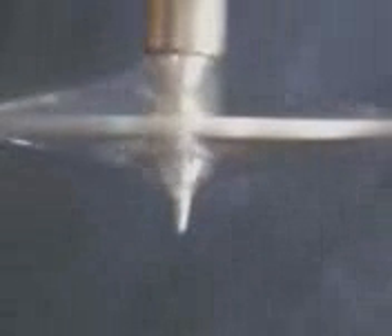Here is a slow-motion view of the tip penetrating the film. You can see that the surface tension forces, through the contact wetting angle, distort the shape of the film and pull it up onto the barrel of the soldering iron.